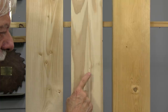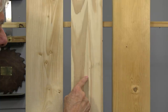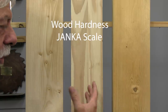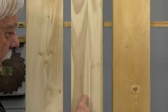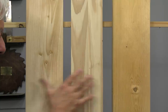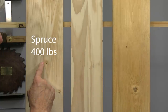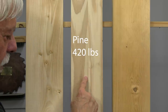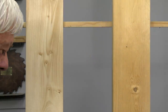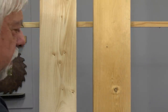I'm going to take out pine because I've already covered that in another video — I'll put the link at the end of this video. Before I do, I want you to know that wood is measured on a hardness scale called the Janka scale, measured in pounds. Pine is typically the softest of these three at around 400 pounds. Spruce is around 420, and fir is actually the hardest at 660. I'm setting pine aside because today we're really discussing spruce and fir, as they're very similar looking woods.